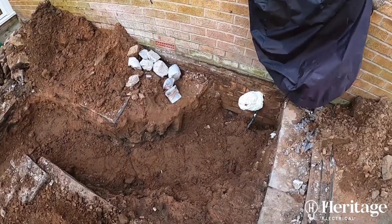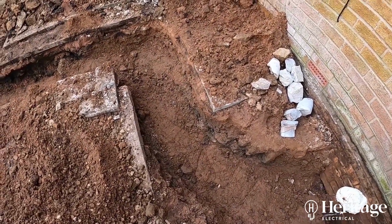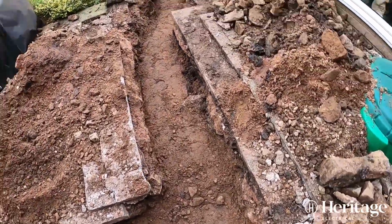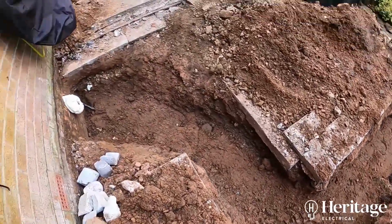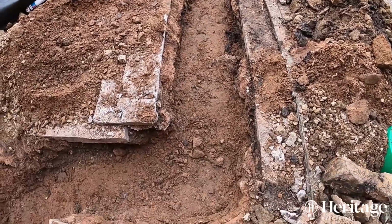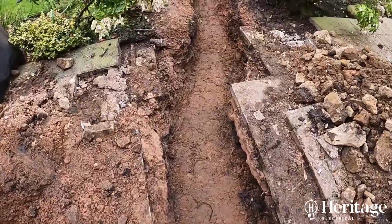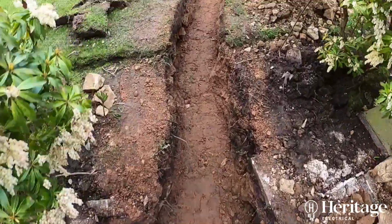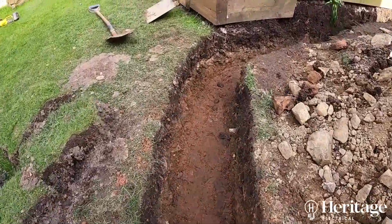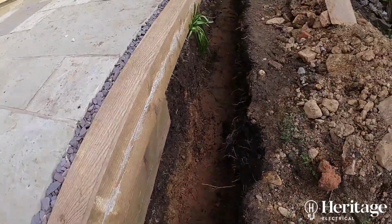Now, this is to allow for a slight expansion and contraction in the ground with heating and cooling, rather than putting the concrete directly onto the cable. And I suppose it also provides that extra little bit of protection from sharp pieces of rock, etc., piercing that outer sheath on the cable. You can see, obviously there's a fair bit of sand gone in there just to use as a bed for the cable, after which the guys are going to mix up a bit of concrete.